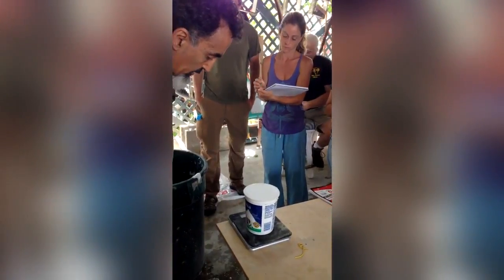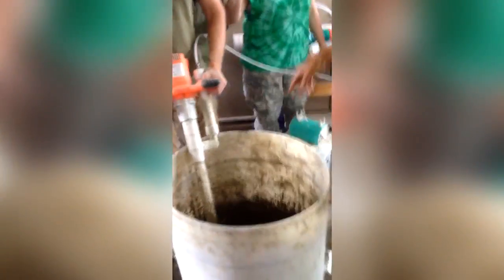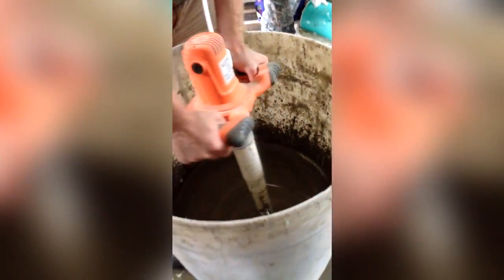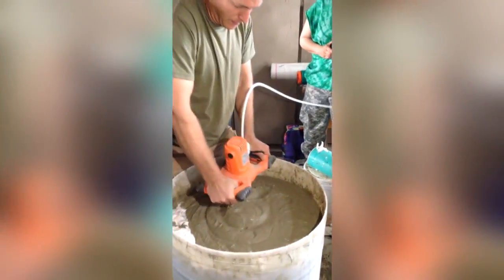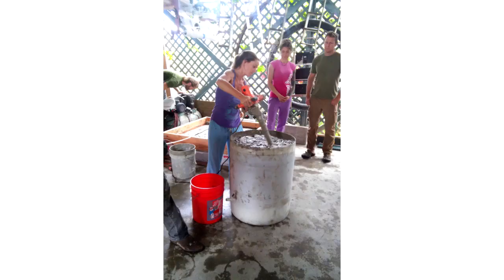Once your foam is the ideal weight, attach the little dragon to your foam injection mixer. Keeping the mixer blade at the bottom of the barrel, turn it on high and then switch the foam machine back on. Mix and swirl, keeping the blade at the bottom of the barrel until the concrete has inflated to 43 gallons. Have your helper turn off the foam machine, mix the last little bit of foam in, and congratulations — you have made your first batch of AirCrete.